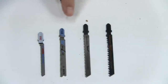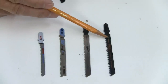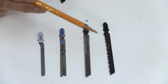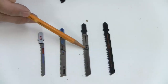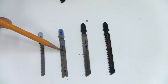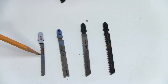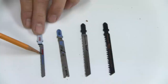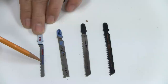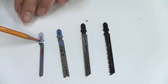There are many different kinds of blades you can get for jigsaws. The most common, of course, is the wood blade. There is a coarse version, and there's also a fine version. You can also get specialty blades — for example, this is a metal blade for cutting through different kinds of softer metals. And this is a fine cut blade; you'll notice it's very narrow and it's for doing scrolling. So if you need to cut tight circles and that sort of thing, that's the kind of blade you would use.